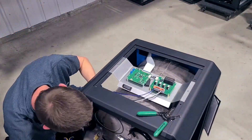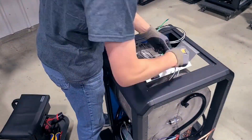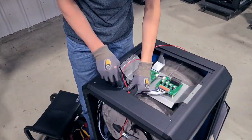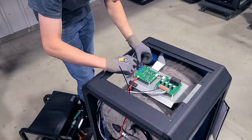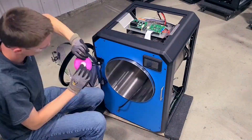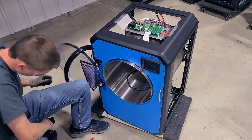There are other brands of freeze dryers that have a ton of wires going everywhere. What we did is simplify that by putting as many of the circuits on the circuit boards themselves, so if something does fail on the circuit board side you can just replace the circuit boards and you're not chasing wires all over the machine.